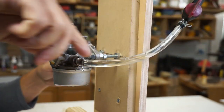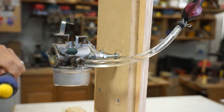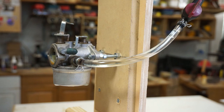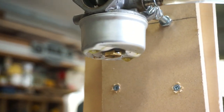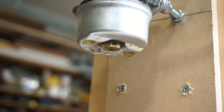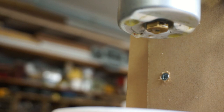Let's go ahead and turn on the fuel. You can see it's flowing down — we'll fill up the bowl and give it a little tap just to make sure the needle isn't stuck. Watch and see — it's already happening. Coming from down below. Let's see if we can get a good look at it — you can see we're leaking somewhere, and it's major.